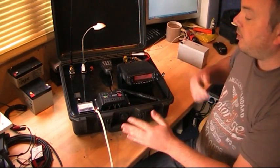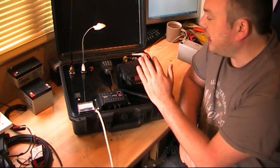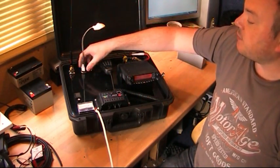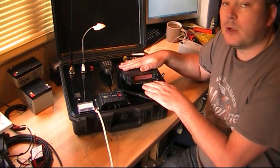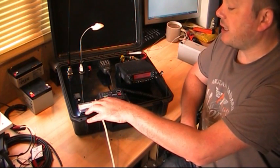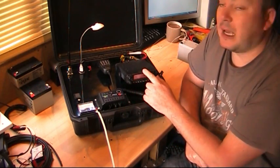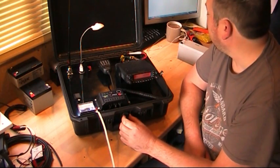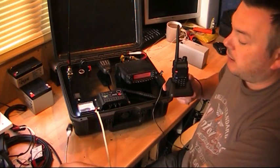The limitation with this setup is that since the radio is wired directly to the battery, it bypasses the low-voltage protection. The other ports will cut off once the battery drops below a certain voltage, but the radio stays on. So I need to keep the controller powered on so the voltage is displayed and I can monitor it — if it gets below around 11 or 12 volts I need to switch the radio off to avoid damaging the battery.